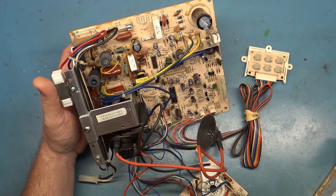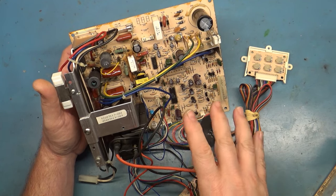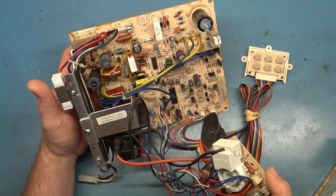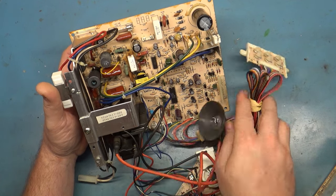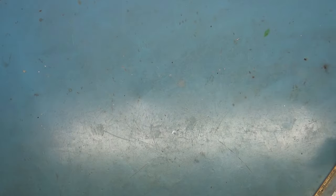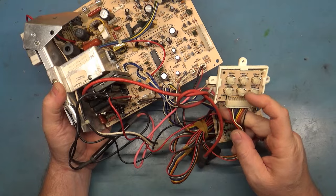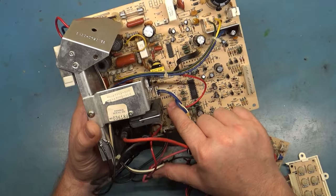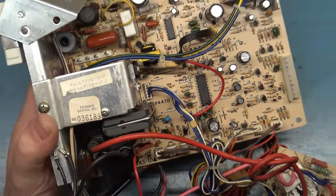He actually has another chassis that he hooked up to that same tube — same tube, same connections, same cabinet, same everything — and the other one did not have an issue. It turned on and operated just fine. He sent that one to me as well because he wants it rebuilt, and it's right here — the same type of thing: remote board with ribbon cable, flat type pots, brown PCB. This one is actually a P447 Delta. I'm not sure what's going on here — you don't see a lot of these versions of the K7000 out there.